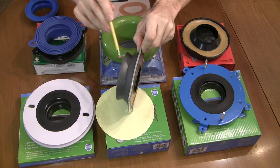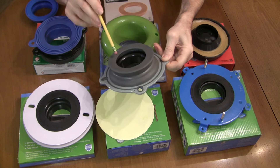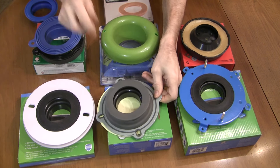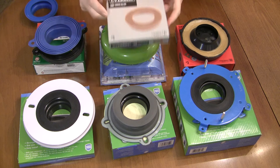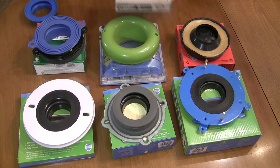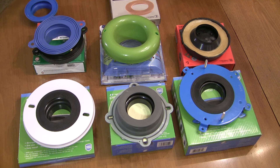The wax compresses and the rubber seals off that area — pretty good idea. Supposedly you can pick the toilet up and put it back. The big advantage of not using wax is that rubber has buoyancy and springback. With a regular wax ring you set the toilet on it and that's it — you can twist it a little but you can't pick it up. So that's the advantage of these rubber products. I wanted to find something made in this century — toilet mechanics feel so ancient.